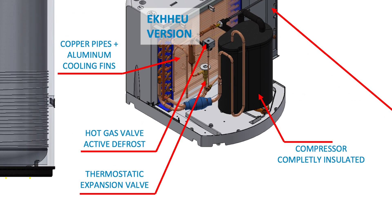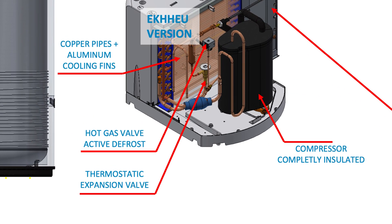The Thermo domestic hot water heat pump has an automatic evaporator defrost function, which is activated when the operating conditions require it during operation of the heat pump. To prevent the heat exchanger from freezing up, a hot gas is injected into the evaporator for eight minutes. During defrosting, the heating element is temporarily deactivated by default, unless changed in the settings.